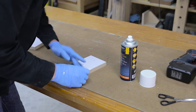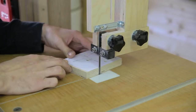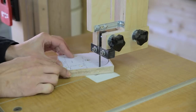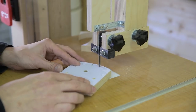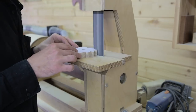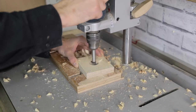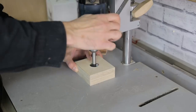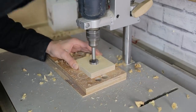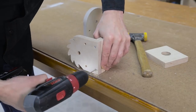Now I'll build the upper elevation and tilt head. I glue the printable templates on the plywood, drill all the holes, and cut the parts with a bandsaw. With the belt sander, I finish shaping the teeth on this part. I drill holes in these other parts through which the aluminum pipe will slide. I ensure the movement is smooth and put all the tilt head parts together with screws.